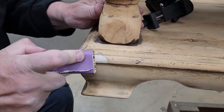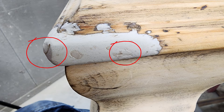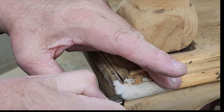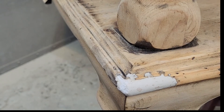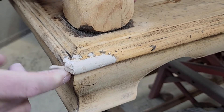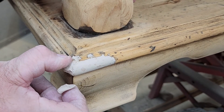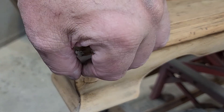This whole piece is getting refinished, so we have some flexibility. Right here you can see I need to put some more epoxy on the corner and fill in some of these holes — there's kind of a blank spot. But I'm a good 85% to where I want to be. So I'm roughing up this corner with a razor blade to create some teeth, since it's a little smoother than I want. Now I'm going to push my epoxy into those grooves, and when it dries it's going to hold on and won't pop off.